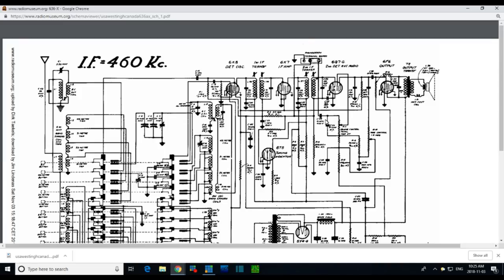Another thing too is if the capacity of this capacitor were shot, so it's more like an open circuit here, then you wouldn't get much signal making it through, and that would also quiet it. So, you know, that could be another aspect, the leaky bias problem could be a wrong idea. Could just be this thing was no longer a 0.01, it was a 0.0001 or something like that.